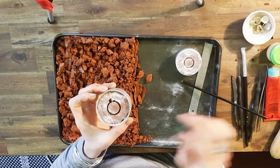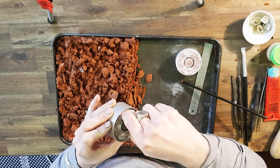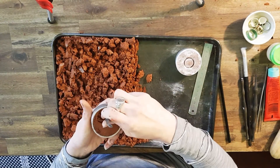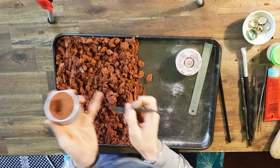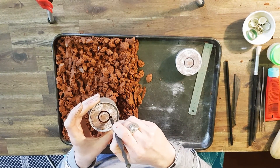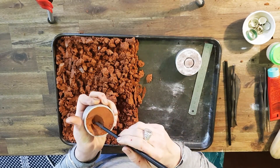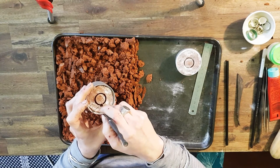I'm going to put the ring back in and tidy that up a little bit, just because I know that I've disturbed that clay a little. It's a good habit to get into. Flip it over — we want to carve a funnel now. Using your knifey tool, carve out a funnel. Make sure it's nice and deep; deep is important because we don't want that silver bottlenecking any longer than it has to because as it's bottlenecking it's cooling down rapidly and potentially won't fill your design. We want to make sure this hole and the funnel are nice and clean with no loose bits of clay that will follow our silver in. I like to use the back of my paintbrush as a rolling pin and just smoosh down all of those loose bits of clay, and I use my sharp tool to run around the inside of that hole and burnish the clay.